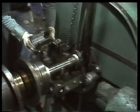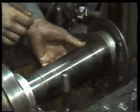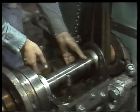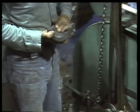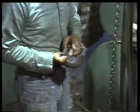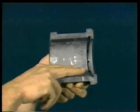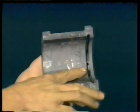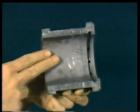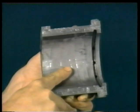The next step is inspecting the shaft for high spots, scoring, or discoloration. Here we've got some minor scratches — possibly a sign of more serious problems. Eyes and fingers both play a part in this inspection. The same goes for the bearing inserts. Since the lower inserts bear most of the load, that's where you look and feel for high spots, scoring, wiping, and discoloration. In this case, we've got scoring — that's why this bearing was overheating. Some particles of grit may have gotten inside through the lubrication system. But with light scoring like this, all we'll need is some simple precautionary maintenance.